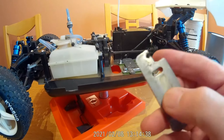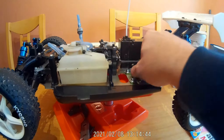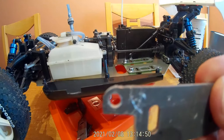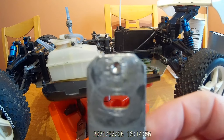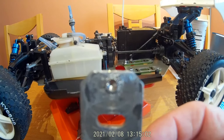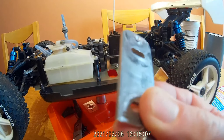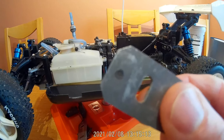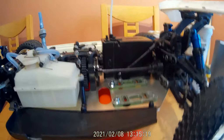I don't know if that hole is threaded - I don't think so. There was a bolt on that side that looked like it was held in with Araldite or something quite substantial. On the other side, the bolt snapped off in it and I haven't the means of getting that out. Maybe if I use a reverse drill like a stud remover and put the drill in reverse - but it's supposed to screw in there because it's the standard fixing.